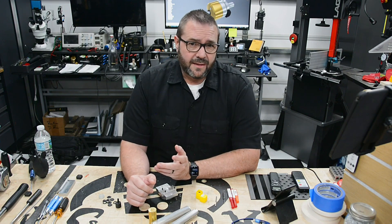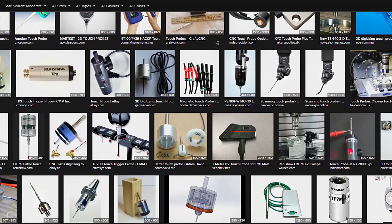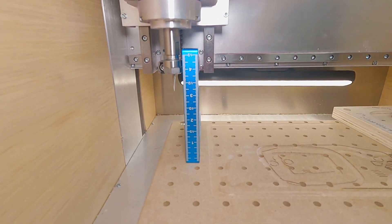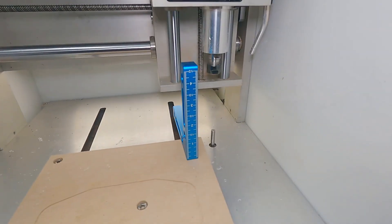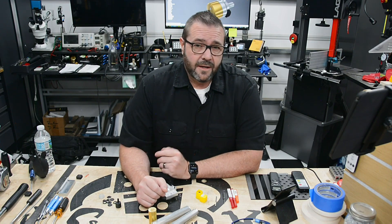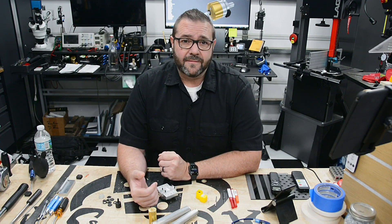While for their big brother this isn't an issue, for desktop mills there are a couple of problems. Touch probes are big — they come in all shapes and sizes, and mechanical touch probes rely on size and width for their accuracy. Unfortunately, the Z-budget on a desktop CNC is small, generally around 3 inches or less. And while probe blocks are useful for finding corners and surface height, they can't be used for advanced surface probing unless your part is conductive. I mill a lot of materials on my machines, and unfortunately most of them are not conductive.